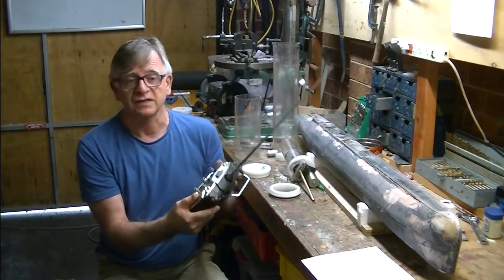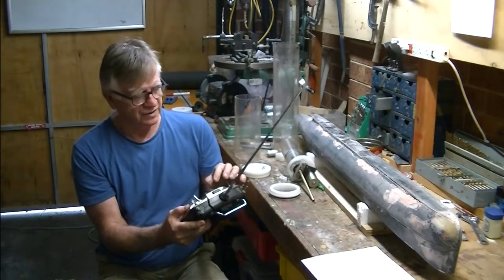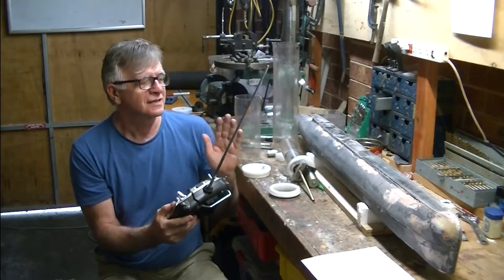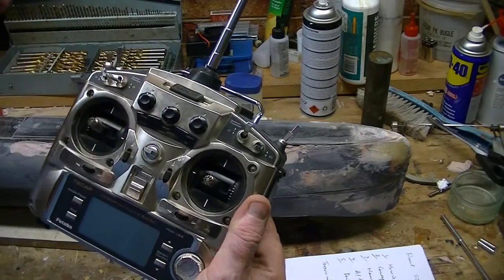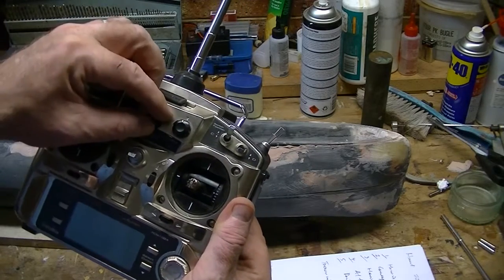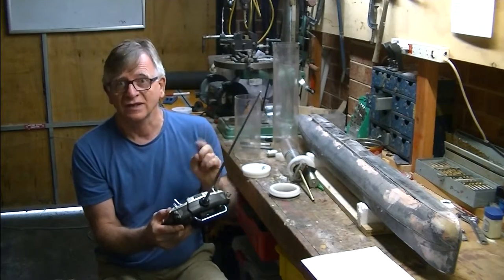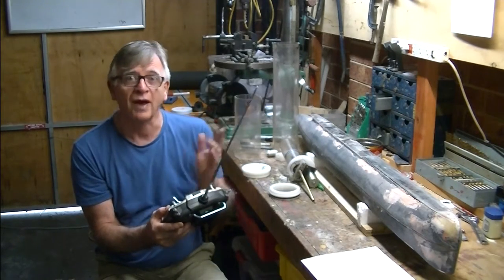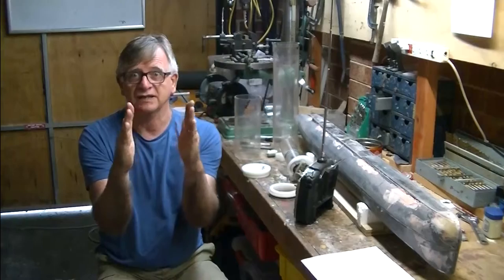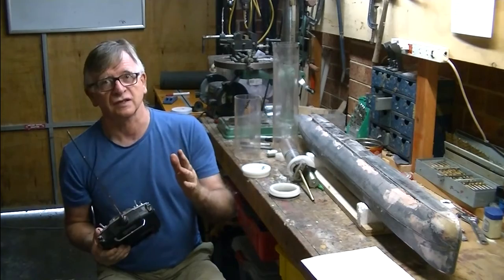I've run out of the main controls now, so I'm going to go to the knobs. I'm going to put a channel through one of these knobs. This first knob here — when I turn it to ten-to, it's going to fill the ballast tank with water. When I turn it to ten-past, it's going to empty the ballast tank. Clearly in this model, the boat has to approach the surface for that to work. Now both of these switches are going to have a one-second delay so that I can turn the knob all the way around and do something else if I wish. Twenty-five-to is going to hold the bow hydroplanes up against the side of the boat, and when I turn it back they're going to slowly open — really majestically, I hope.